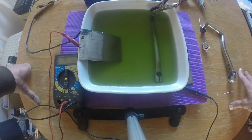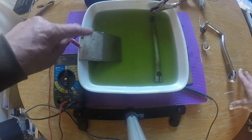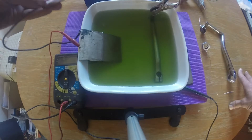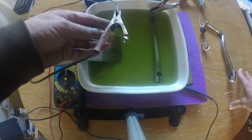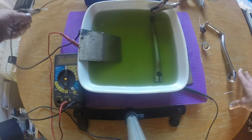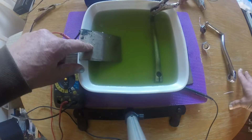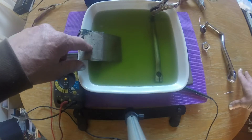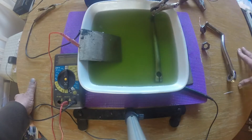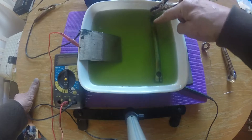To make sure I don't forget, I've actually soldered a bit of cable onto the nickel and put it on the positive — red for positive — as a constant reminder that I get it right. So I always remember: the big piece of nickel is what I'm plating from on the positive, and the negative goes onto what I'm plating. And I can see already there are bubbles appearing.